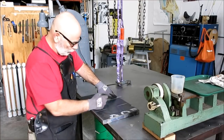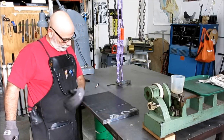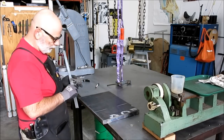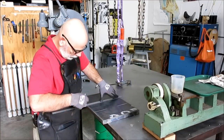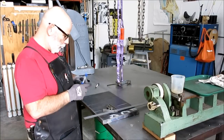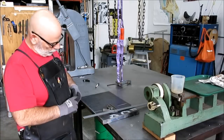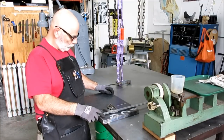To go through this mill scale you need a pretty good tool — this is a carbide tip scriber here. You can hear it breaking up as it goes through. Uh-oh, that's a bad looking line there — looks like it moved a little bit. The question is always which line am I following? I'll deepen one up a little bit, and just so I don't invite Mr. Bozo to the shop, I'll darken that other one just so it doesn't show up as well. It actually doesn't even matter because it's wider than it needs to be at that point.